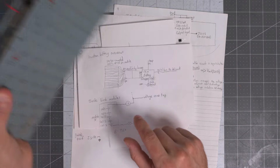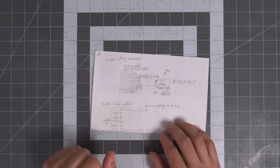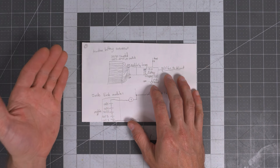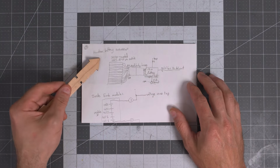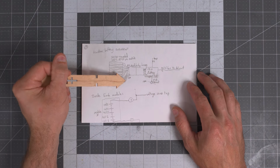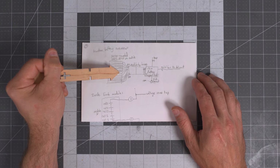So let's look at an overview. Before we dive into the details here, for people who aren't as immediately familiar with what's going on in the system, let's look at the traction battery in a nickel metal hydride, for example, a Gen 3 Prius vehicle. This has a traction battery. It's got a bunch of modules that are stacked together all in series. And periodically throughout the nickel metal hydride pack, there are voltage sense leads, but there's not one for every cell. And for nickel metal hydride, that is safe.